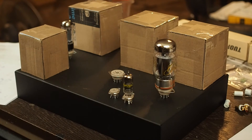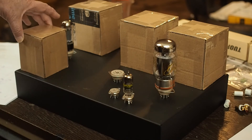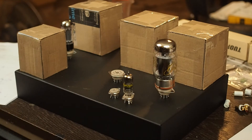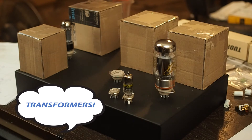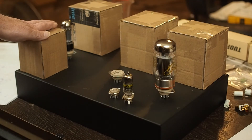What these little cardboard boxes are — I went to the EDCOR site and got the dimensions of these transformers. Using a vernier caliper, I cut out these little cardboard boxes and taped them up to the exterior dimensions of the transformers, so I could start playing around with the layout while I'm waiting on the iron to get here. This is going to be the power transformer, these are the two output transformers, and this is the 10 Henry choke.